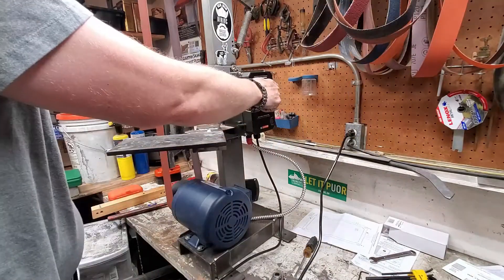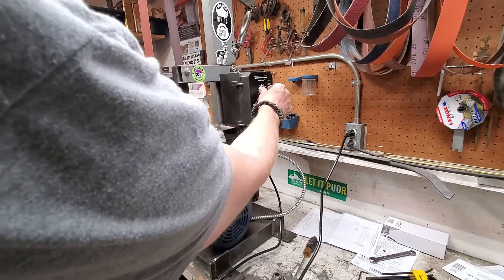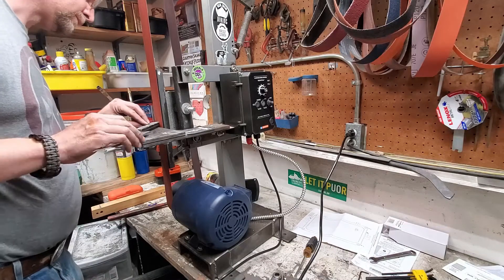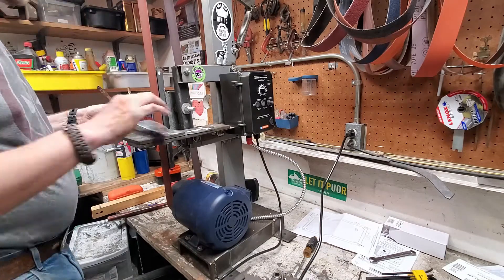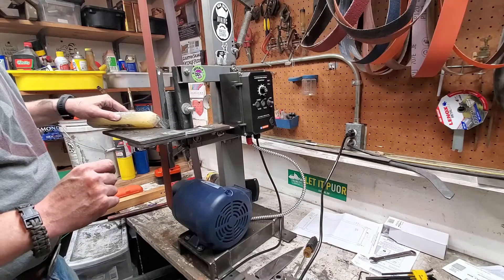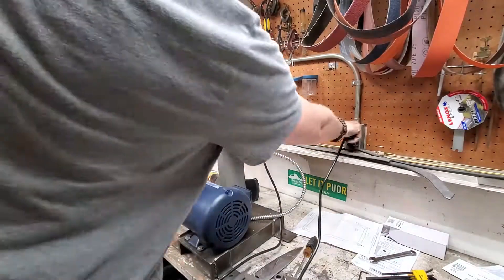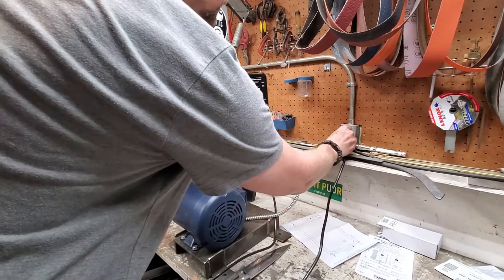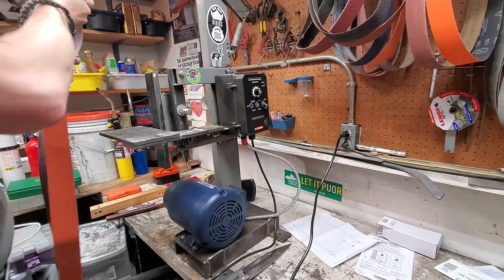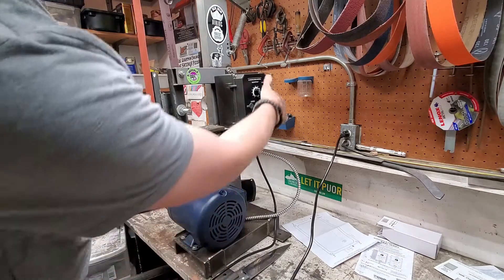I've got to put the woodruff key back onto the motor and then pop the pulley back on - using a rubber mallet so I don't scar it up too much. Pulley is back in place. The motor's still loose so I can get everything lined up. I take a belt out just to give me a visual guide, get it onto the tensioning pulley, and then line everything up. Once I'm satisfied it's all lined up, I tighten up the motor and fix it in place. Now it should be good to test out - look at that, it works! I've got the speed control on my belt grinder now. It cost me about $550 to do it. I paid $300 for the grinder originally - built by my friend Steve Goddard locally - then $550 in the motor and speed controller, so that's $850 total in the grinder. That's pretty good.